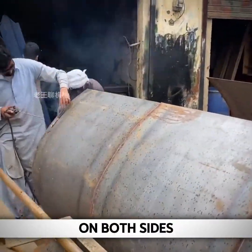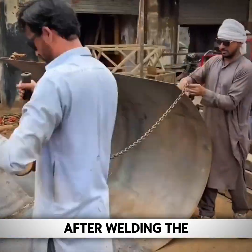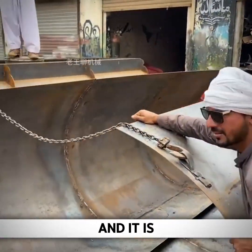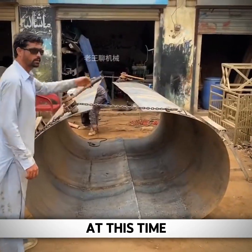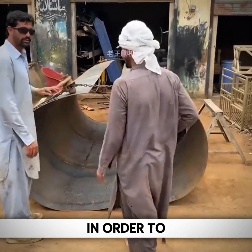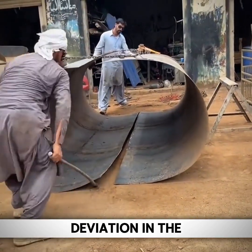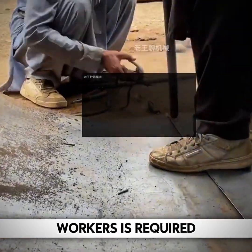The iron rings on both sides need to be welded to facilitate the fixation of the steel plates. After welding, the steel plates are tough and not easy to splice. Workers tighten the hanging chain at this time, and after the tightening and over-adjustment is completed, the splicing joint can be welded. In order to ensure there is no deviation in the arc of the splicing joint, the tacit cooperation of two workers is required.